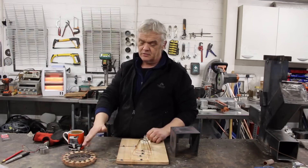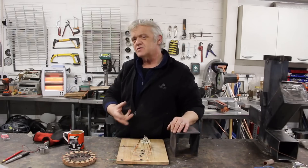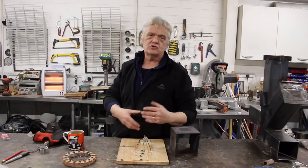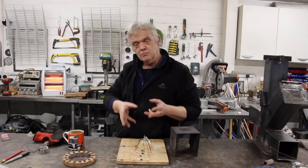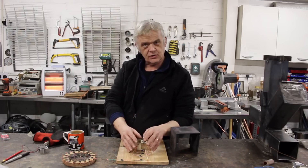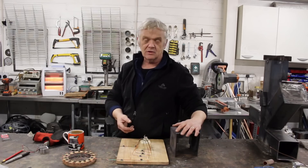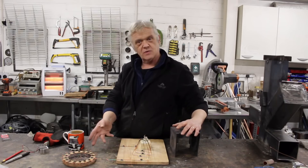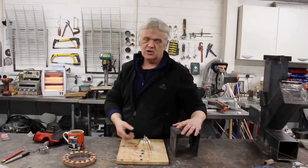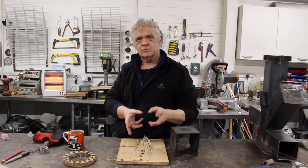This one has got nothing to do with that. Actually the heat that we apply is relatively inconsequential. This is much more similar to a standard motor or generator — it uses the movement of a conductive fluid through a magnetic field. These are only electrodes to pick up the current; they don't actually do anything in themselves. This could be absolutely anything that would conduct. I used copper because we have it, but it's not a particularly good electrode material. Tungsten would be good, nichrome would be good. The metal itself isn't contributing anything to this setup at all.